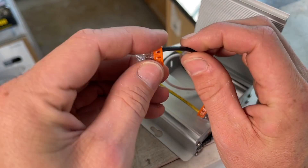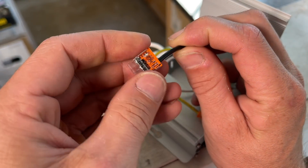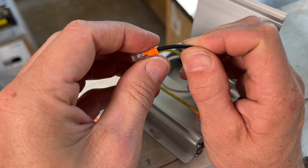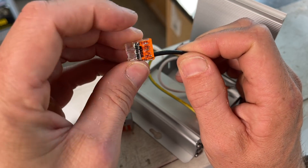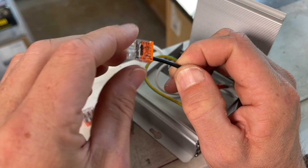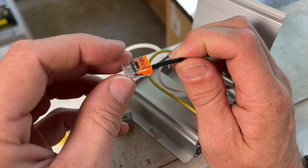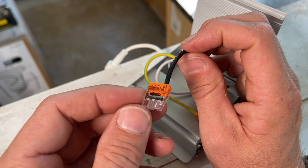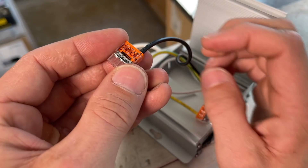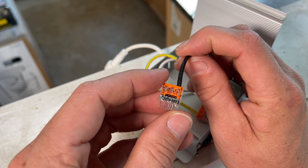The connector we're talking about is made by a company called WAGO and it is a 2273 push-in connector. It is tiny — about a quarter of an inch high, half inch wide, and then depth is about five-eighths of an inch. I can't imagine you getting a wire connector much smaller than that that can actually do the job. I don't love push-in connectors, especially for high-load applications, but for something like this where it's an LED recessed light and low load, I think it works well.